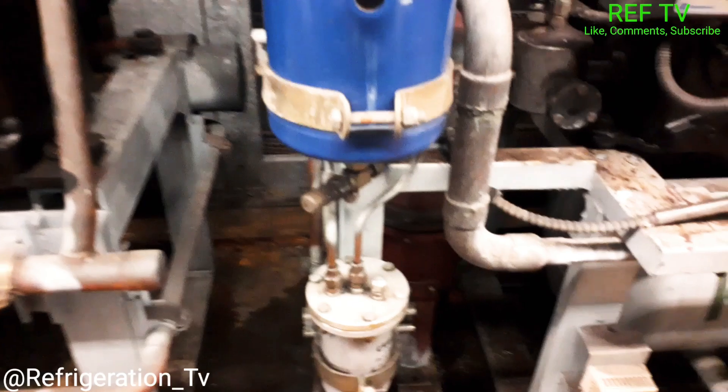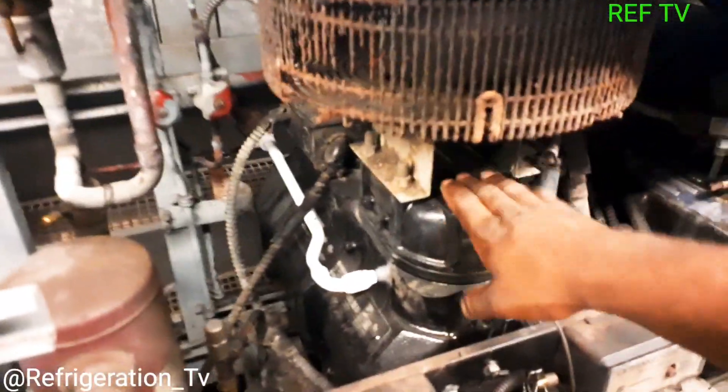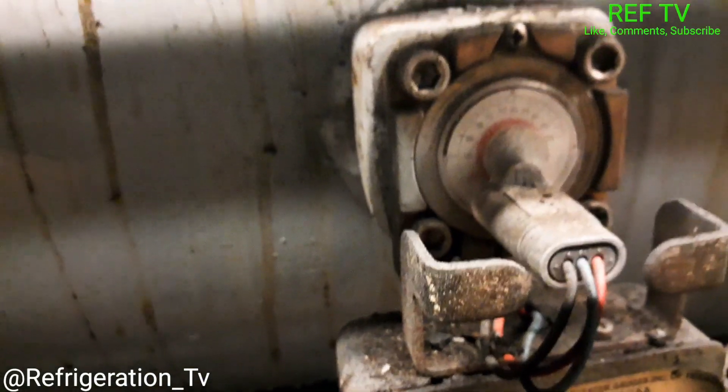This is our rack — we got one ball of oil right there. Look at that demand cooling, our compressors are running, it's hot — that's good. Let's just touch the back of the suction bell, make sure they're not warm. That feels good, no valve plate leak in there. Let's check out our sight glass now — liquid level, we're at zero percent.